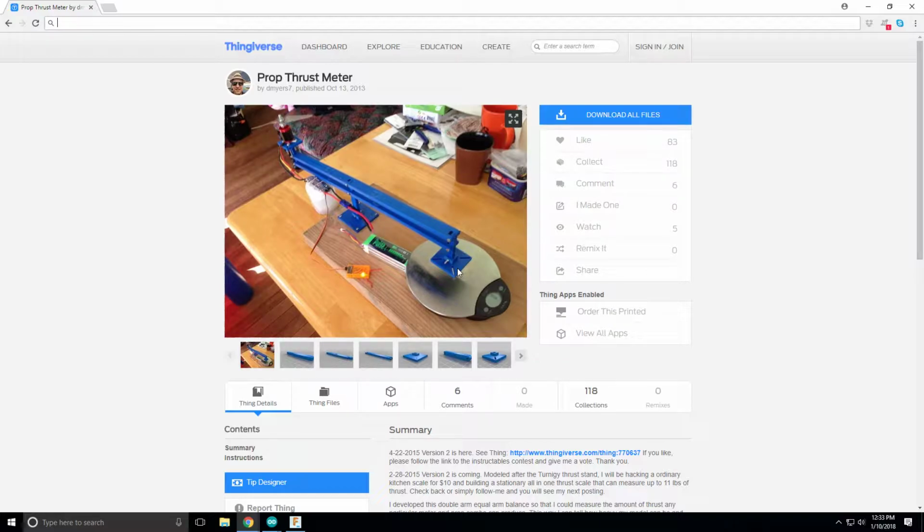So now if we apply a 25 gram torque, which is 50 gram force on this side, divided by 0.6. So here, if we doubled this length, if this length was double this length, and we put 50 grams of force upwards here, we would only see 41 grams here. So that way we've scaled down our force. But obviously if you do a massive motor on this side, this thing has to be really long.